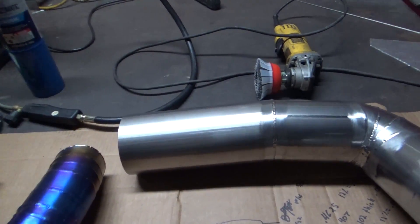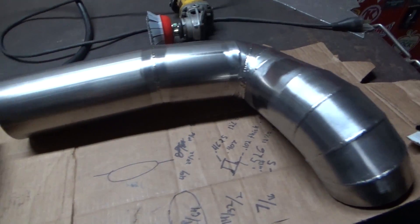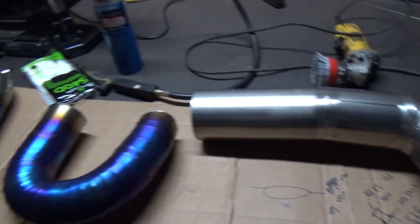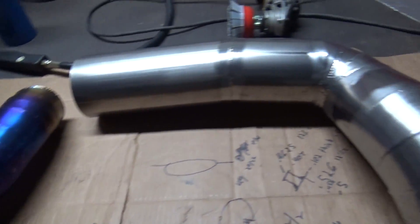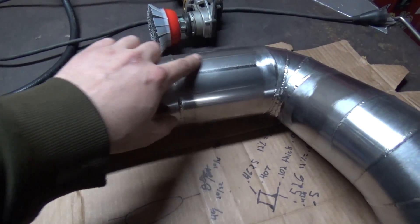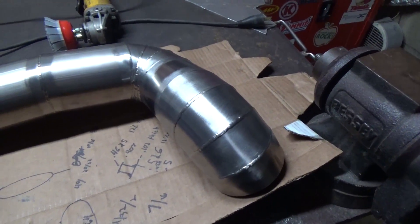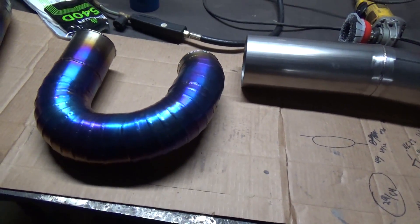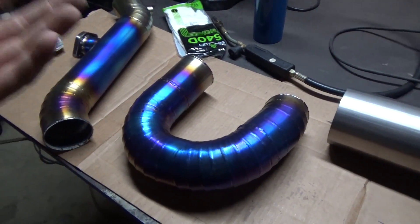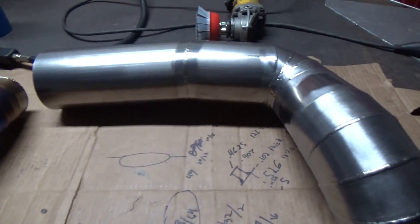In a lot of pictures you see online, the welds are blotchy and discolored. The key is you've got to polish the whole pipe evenly first. The degree to which you polish your pipe will also reflect how bright the color is — the duller the metal, as you can see right here, isn't reflecting much light. Over here where it's partially polished it's reflecting a lot more light. When you add the color to the titanium, it's going to reflect more of that light back to your eyes, making it a brighter color.